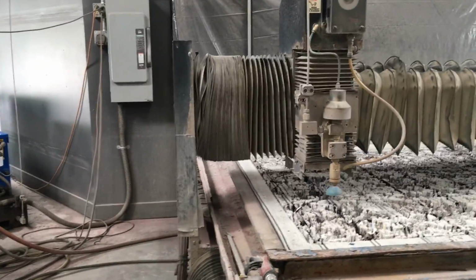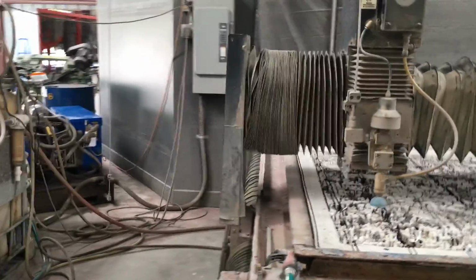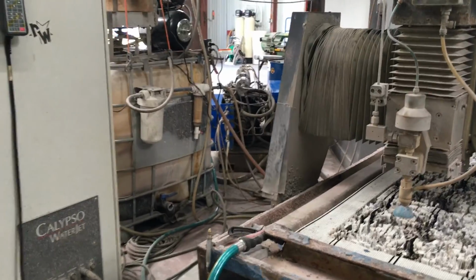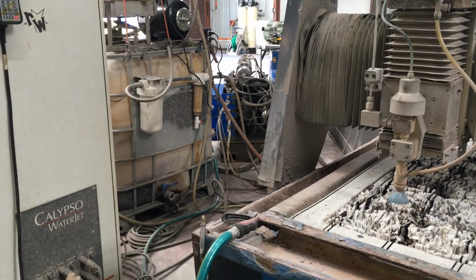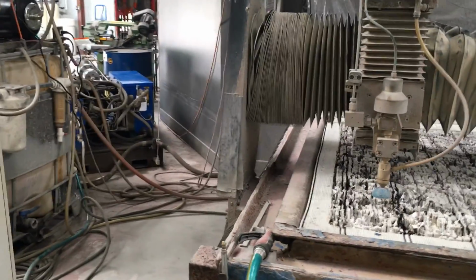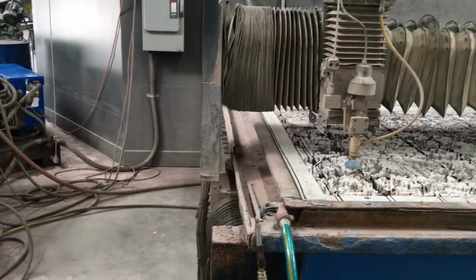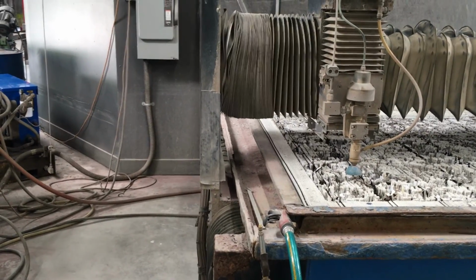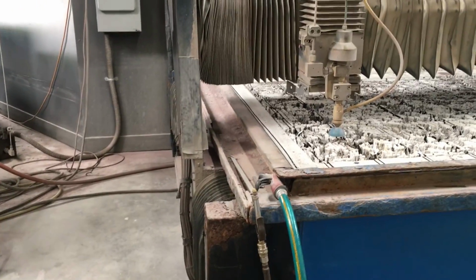So I know I have 6 inches of travel. So here I go, I'm 5 down. Let's say that's 5 down, and now I want to go J2. This is set to 1 decimal point, so this is 100 down. Now I'm dropping to 100 down. If I'm still not there and I want to get dialed in, I go to J3, which is 10 down. You can see it. If I go J4, that's 1 thou. You're never going to see it.